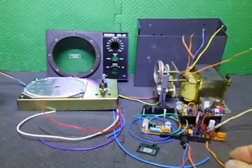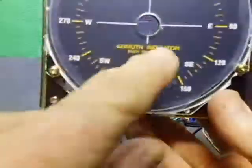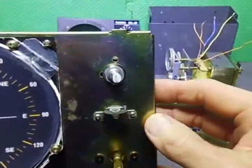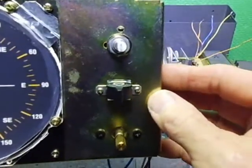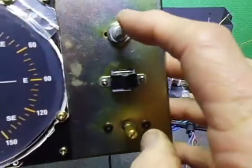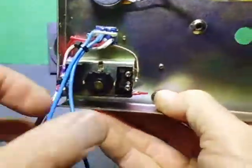More updates: I had to bore out the middle hole in the display for the needle. I've also converted the controller's potentiometers from 500 ohms to 5k potentiometers, which meant I had to change the preset potentiometer as well. I've rewired most of the wires on this part of the board.